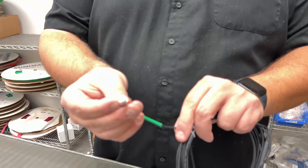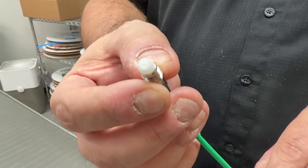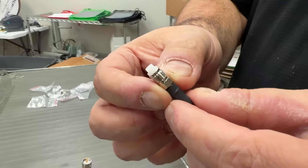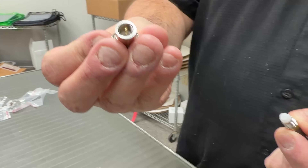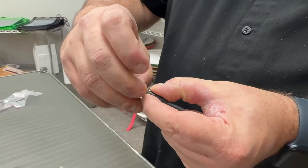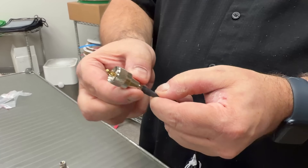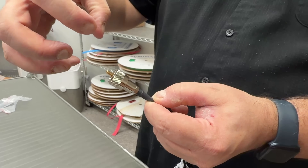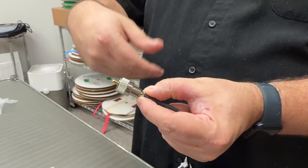The nice thing about the FME that you see here is it's a very small design, but it's got a locking hex piece in here. When you think about mating adapters, normally people are just threading upon one end versus the next. But the beauty of the FME, which has the really tiny, tiny pin, is when it locks, it has a seamless look to it so that it prevents anybody from being able to twist or accidentally pull it apart like a BNC has those spring fingers on there.